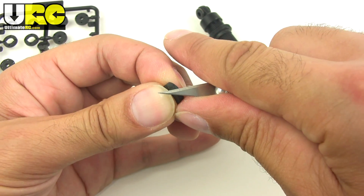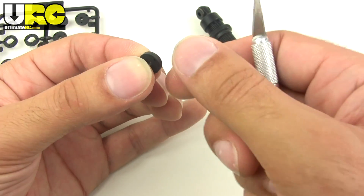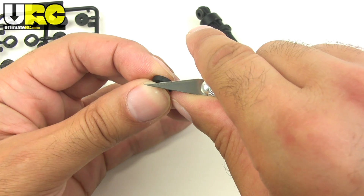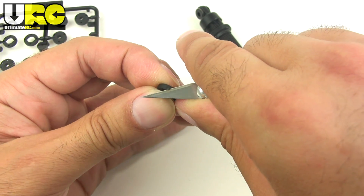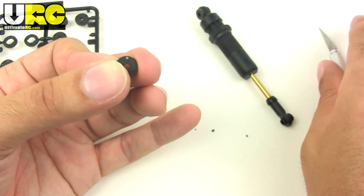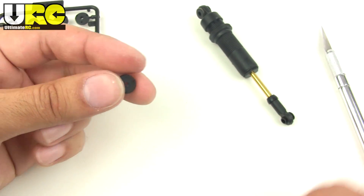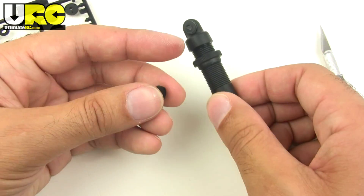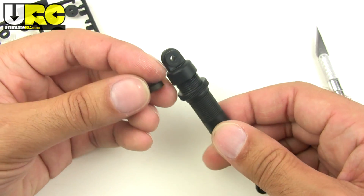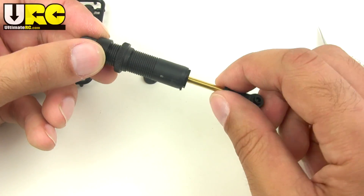Trim it off and make sure that it's nice and flush. If anything, you can go a little bit farther, a little bit deeper, but the preferred cut would be just to make it flush and turn the whole thing into an even circle all the way around — an even shape. Once you have that trimmed up, you'll see how little plastic actually came off. Just put that back in — washer first, then piston, then washer, just the same way it came out. Put the nut on top and use your little T-wrench to stick it in there, hold from the other end, and just screw it in.